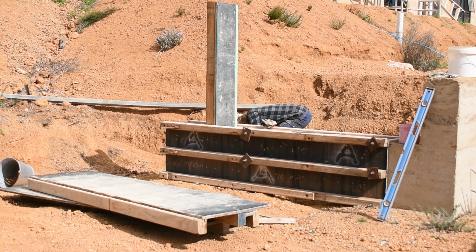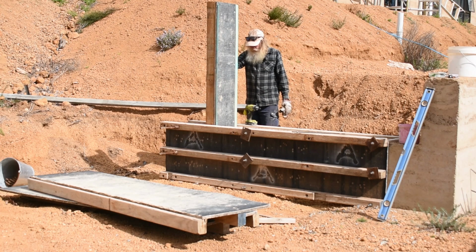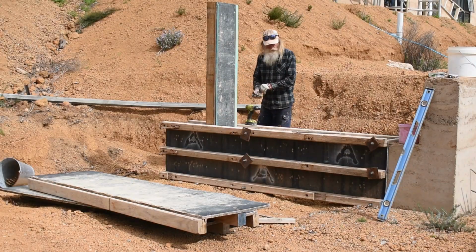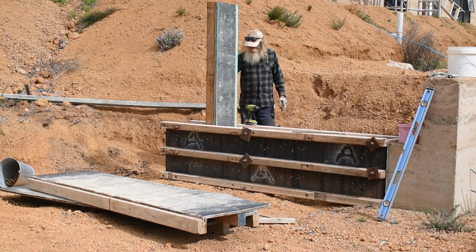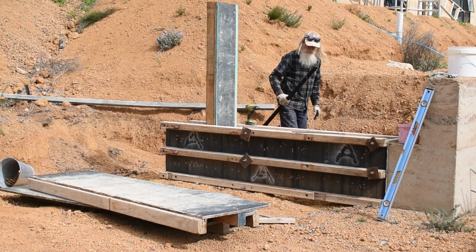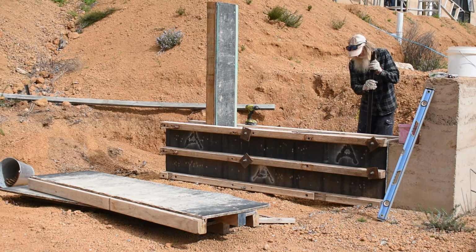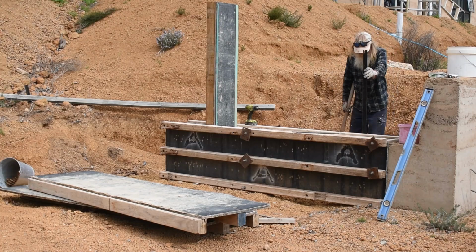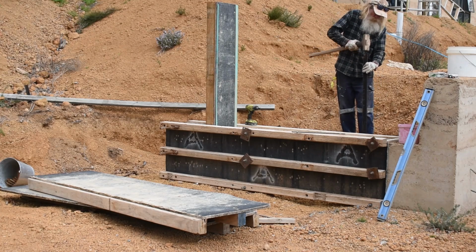It's your beauty, just use some wood. That's in there. Yeah, I've got to brace it. I'm going to brace it up there. But what I normally do, if you're working on the slab, you'd be making sure it doesn't move that way, make sure that end, so it'll all be braced off. But what I'm doing with these retaining walls is I just bang a star picket in, and that star picket will stop it moving that way a bit and stop it moving that way. I'm not overly fussed, it's just a retaining wall, but if I was on the slab building my house, you'd be wanting to make sure it doesn't move at all.